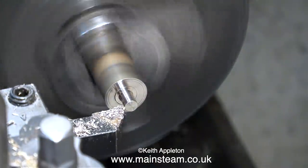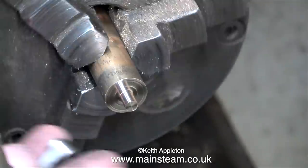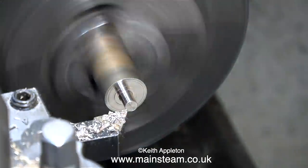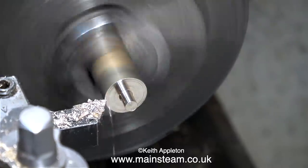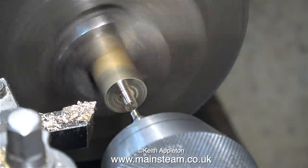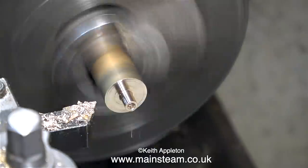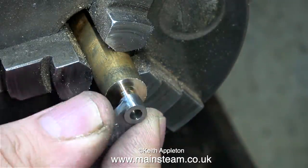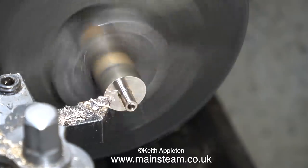For instance, if you put a piece of bar in the chuck and take a really fast cut down it, you're not going to get a good finish — even at the outside diameter — unless the piece of bar is revolving at a very high speed. So don't forget, the general rule is: the lesser the diameter, the lesser the surface speed. But if the chuck is fitted with a larger diameter piece of metal, then the surface speed may be excessive.